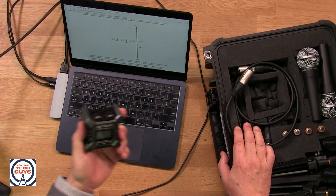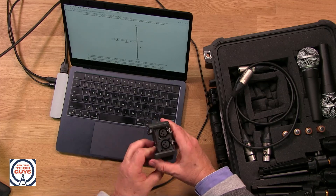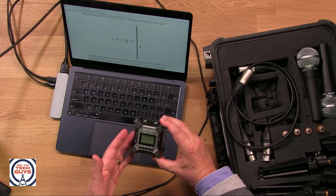So we don't mind storing the extra data that comes with 32-bit float, because I don't have to pay attention to levels. I can just record. I can go out in the field — someone can shout and it will not clip because we're recording in 32-bit float. We're going to take this on the next trip we take. This little thing can record more than 100 hours with two microphones at once. That means you never clip, you never go too loud — your dynamic range is 1,500 decibels.